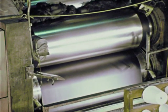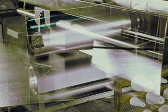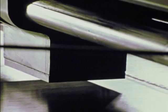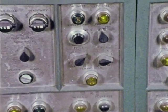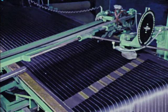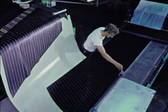This is a calender. Here for the first time, rubber and fabric are combined. Atomic energy plays a role — measuring is done with beta rays from strontium-90, a by-product of uranium processing. General was the first in the industry to use this vastly improved method. After calendering, the tough, atomically gauged fabric, cut on a bias, is spliced a notch closer to the finished tire. Thickness is precise. Angles are perfect. Specifications are demanding.